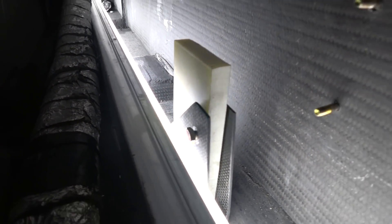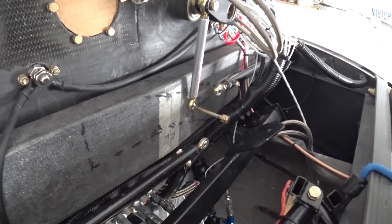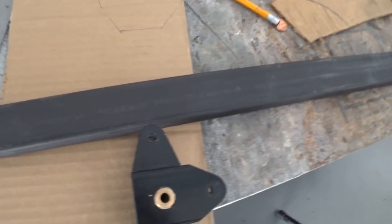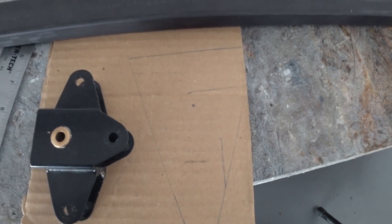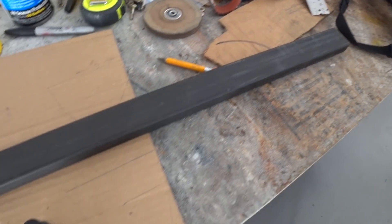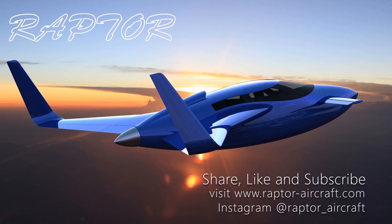I'll be able to use the same fixture up front, although it'll have a different hole position — I'll figure that out later. While waiting on the pulleys to arrive, I've started on another project: counterweighting the elevator. I've removed the little bell crank and I'm going to have Brit weld on part of a length to it. I'll create some supporting brackets — the top one fills in around there to brace it up, and the bottom one carries all the way down to carry the loads of the weight out to the elevators, with the counterweight attached at the end. That's the update for the first half of this week — thanks again for watching, and thanks to everybody who commented and emailed me. I'll see you again on the weekend.